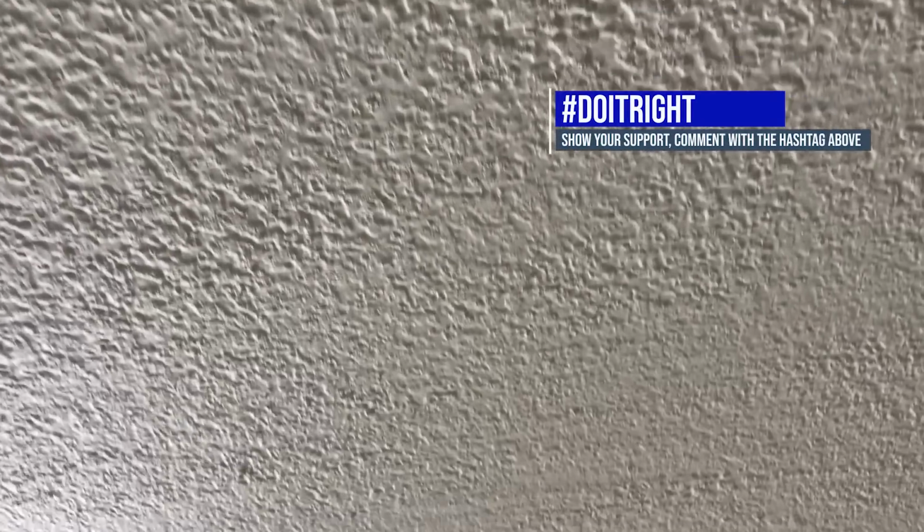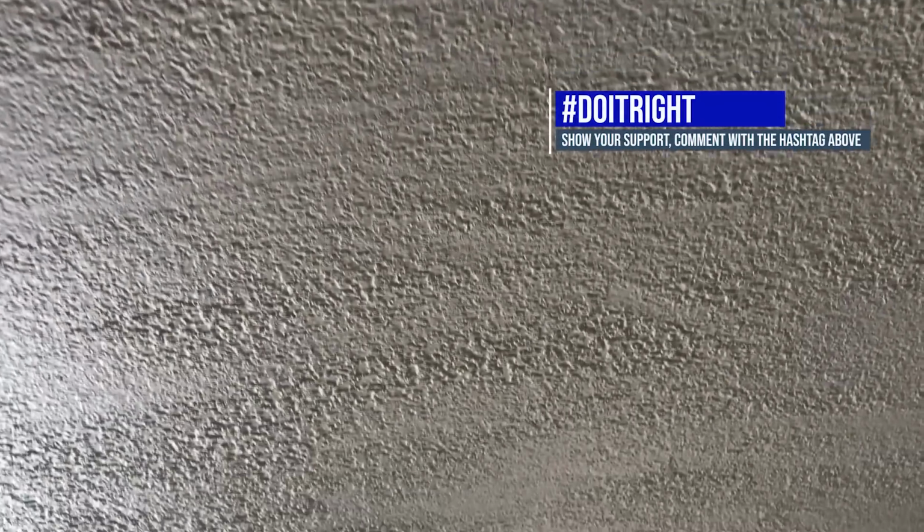Okay, I know how much most people hate this popcorn ceiling texture, so in this next short little video clip, I'm going to point out a few of the things that can go wrong when you just scrape it and paint it. Okay, this clip isn't very long, but you can see the unevenness. What you're seeing is the leftover base of the popcorn. You can see some cracks that didn't get fixed, and it just comes out really uneven. Now, I shot this little video, but I'm going to show you some still shots and point out a few things where I've got more time.